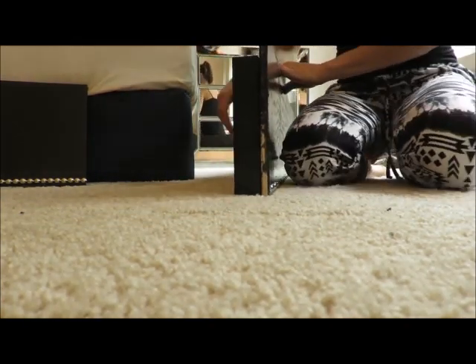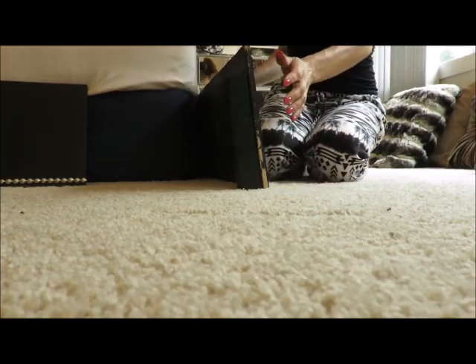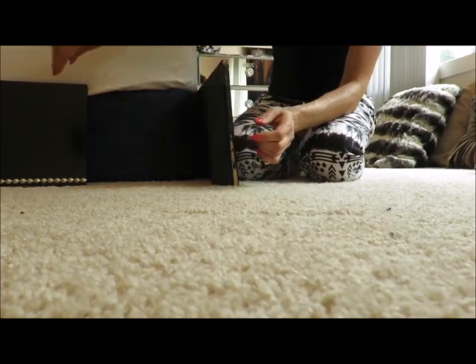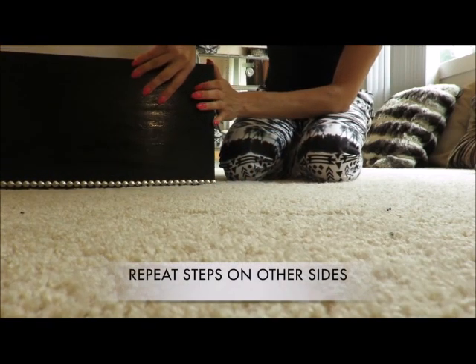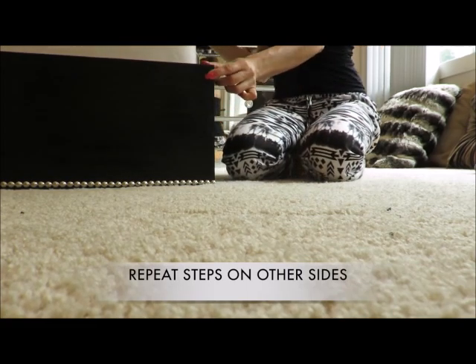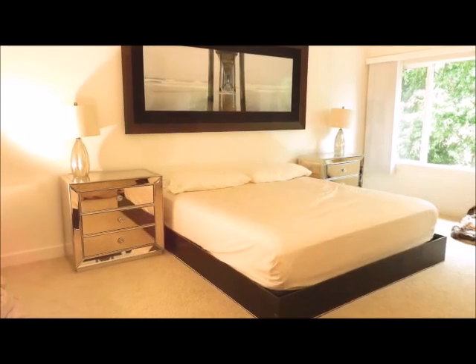Now when I prop that up you can see how that looks. I'm going to slide this into place — as you can see, that edge is not stained because the front panel is going to go right on top of that. We'll put two nails in and make sure they go into the stabilizer wood, and that will hold everything in place. If your nails don't match, you can go ahead and stain over them.